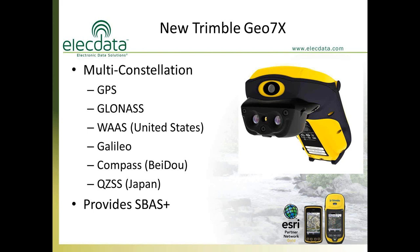This unit provides what Trimble calls SBAS Plus. SBAS is a satellite-based augmentation system — in this country we use WAAS satellites to provide real-time corrections to anywhere from two and a half to five feet, depending on conditions. With a standard 6000 receiver, when you activate SBAS, you'll notice the Russian satellites disappear from your sky plot — they're still being collected, but not used to calculate a real-time position. SBAS Plus means the WAAS satellites can now apply corrections to all satellites in view, including the multi-constellation solution.